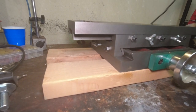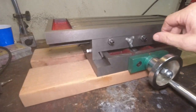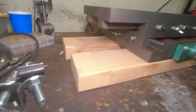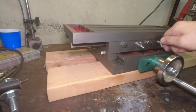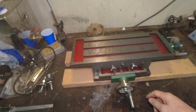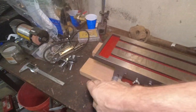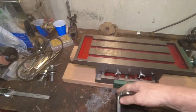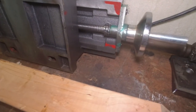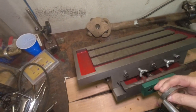As you can see, the machining is still pretty rough. If you really want this thing to shine, you're going to need to take it apart and smooth all of the sliding surfaces down so they slide on each other almost like an ice cube on glass when lubed. I'm not going to do that right now — I want to review it as it comes. I have lubed it and adjusted it as best I could. It's got thrust bearings on both ends. It is cast iron and weighs about 65 pounds. I think it's a diamond in the rough.